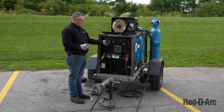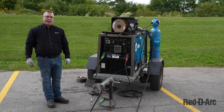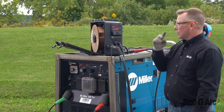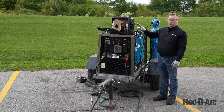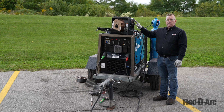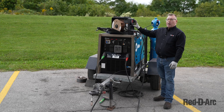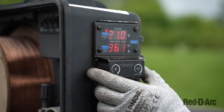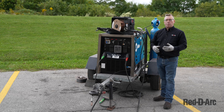For this instance, I will turn the dial and put it on the proper setting for gas metal arc/flux core welding. Once that's set, I can now power my feeder on. As my feeder powers on, this type of feeder can be used very remotely — you're able to adjust your wire feed speed and voltage through the resistance or power being conducted through the welding cable. Right now our display shows voltage and wire feed speed. I can make any adjustment at the feeder, allowing me to be extremely remote from my welding power source and still weld and use the feeder.